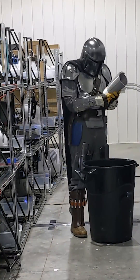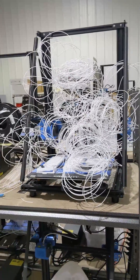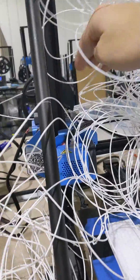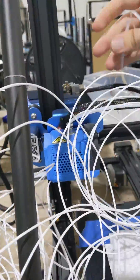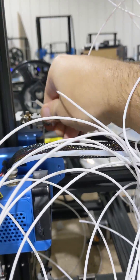So let's get started with one of the craziest problems you might come across. This big mess here is the unfortunate result of a bowden tube fitting either wearing out or breaking. If we look here, you can see that the bowden tube has popped out but the filament just keeps coming out.